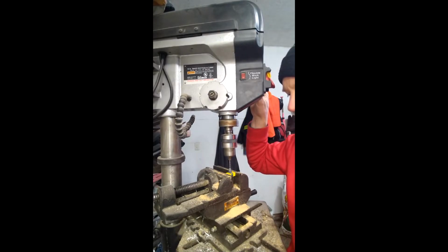We're going to go really light. You need a sharp drill bit because obviously there's a rotary encoder in there, so if you press hard, the encoder just spins like wild. You don't want to do that. You can probably burn out your encoder. But with a light touch, if you just put it real lightly, you'll see the flakes coming out. You'll hear the encoder if it goes. There it goes. Hear it? So you want to avoid that.